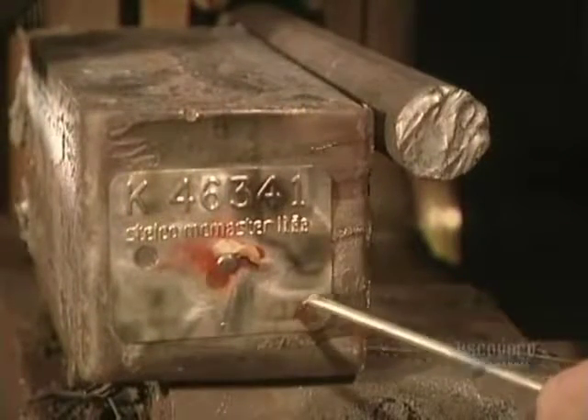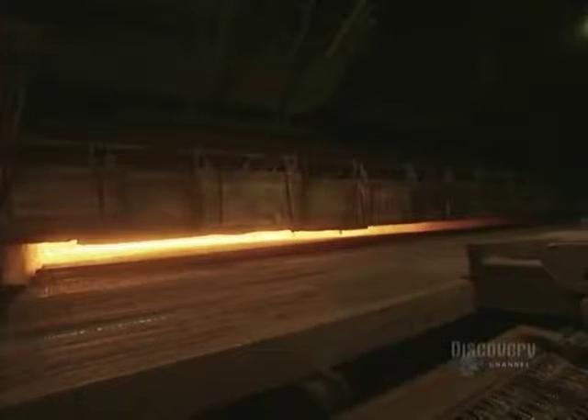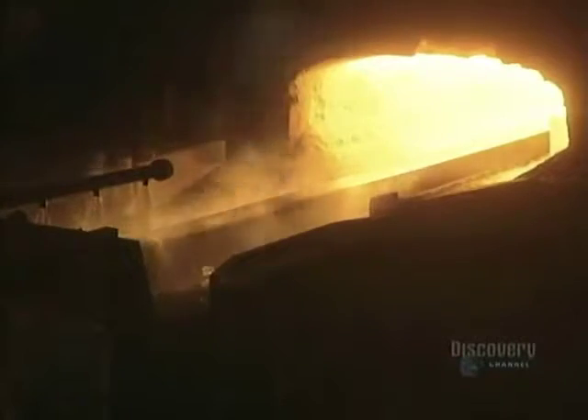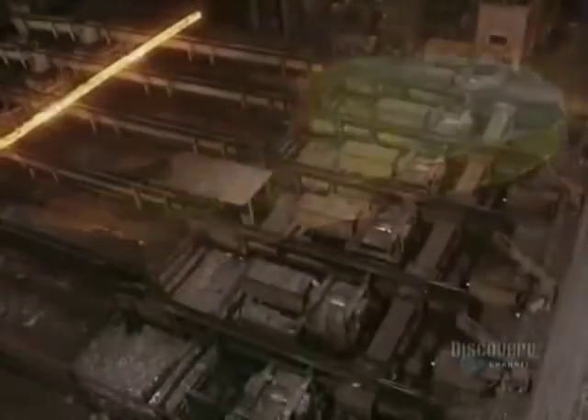The difference between a steel billet and the nearly finished flattened product is clear. Flattening of the billets remains to be done. Before flattening begins, billets are placed in the furnace to be reheated for two hours at 1,095 degrees centigrade. Water jets cool the billet ejector.